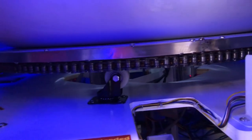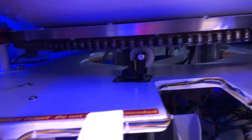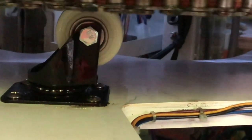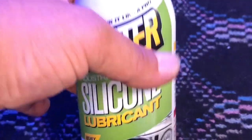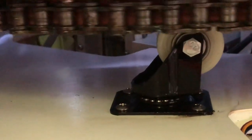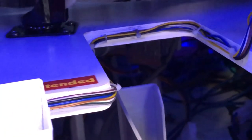I found the squeak — it's one of these wheels down here; it was actually that one right there. There's a whole bunch of them all over the place — there's even those red ones on the end over there, some on this side, and some underneath. They're almost like caster wheels. I started with those two over there and sprayed a little bit of silicone lube into them. I like using 3-in-1, but the silicone lube will be okay. I sprayed that one and it didn't do anything, then I went over to this one and sprayed it, and it quieted right down — the squeakiness is gone. I want to say this game is fixed and good to go. Get some silicone or some 3-in-1 oil and that should do it. Thanks for watching.